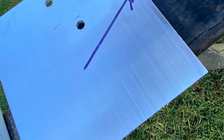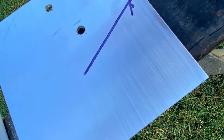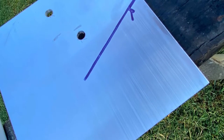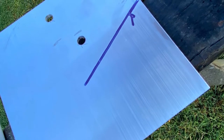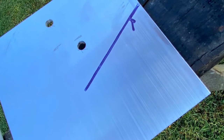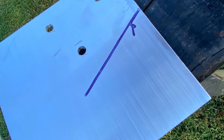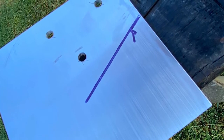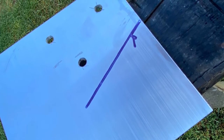The brackets themselves are an L-shaped piece of aluminium. You can see that with this bracket — we'll flip it around in a second. We have put three holes in that bracket; they are 5mm holes. Those holes are to make screwing the timber-fixing tech screws into the side of the timber rafter or truss simpler — it's easier to fit those screws through when there's a hole there already.